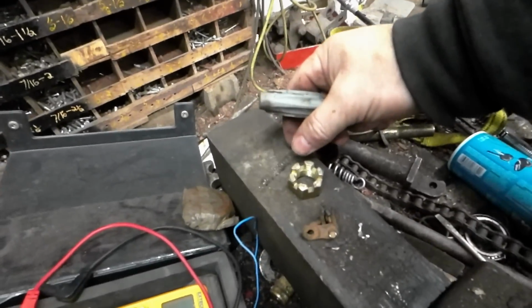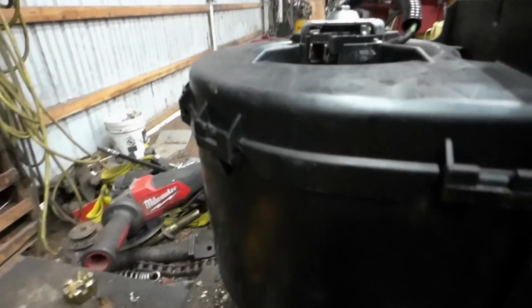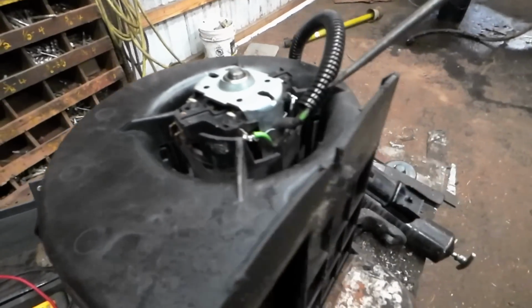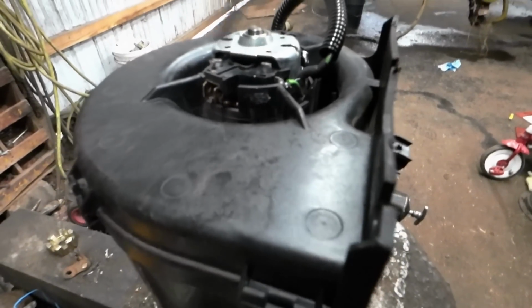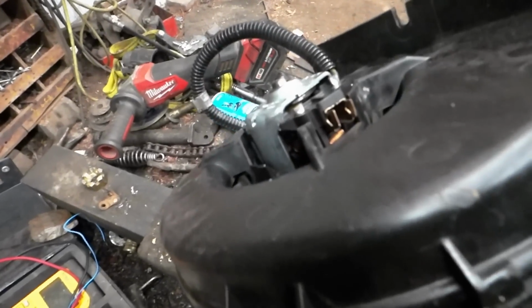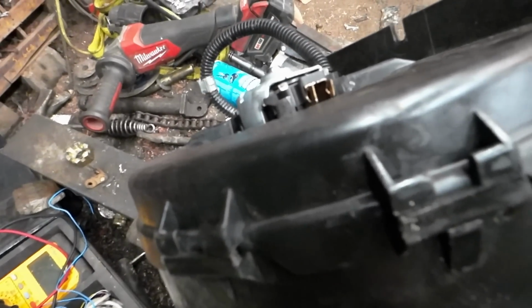So there's a spring. Let's put the spring inside of that nut. And we will just go ahead and take a look in there. What's in there? Well, see, that's the problem. Is that little nut gonna work? Huh. Yeah. Well, let's take it out of there. And we'll give it a tap. I mean, I can see it way down there. This is far from easy to deal with, but you can see the brushes way down there. So those brushes, they're just flat out worn. So, all right.